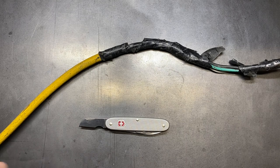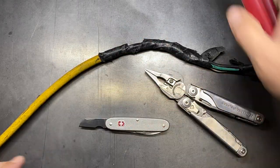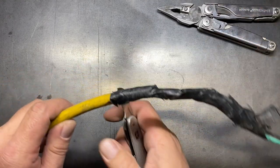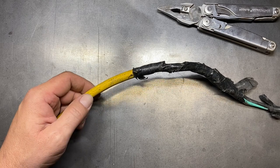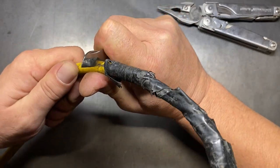Normally I would just cut through it with a good set of cutters like my Kleins, but we're going to try to do this with just the multi-tool. When I'm in the field I have to do this with my Surge all the time — usually I'll just cut a couple places on the jacket, strip the jacket, and get the jacket away before I start cutting on the wires themselves. So we're going to try to do that with the Victorinox Electrician.